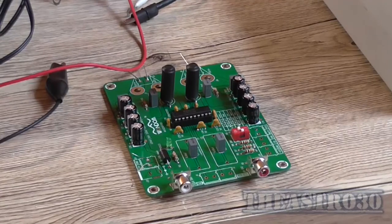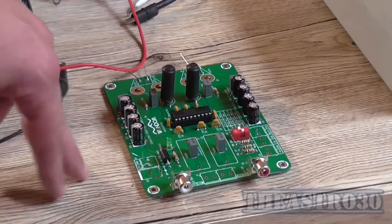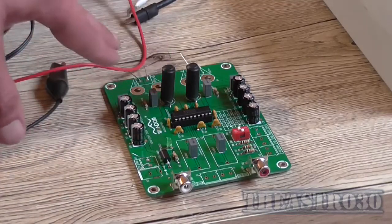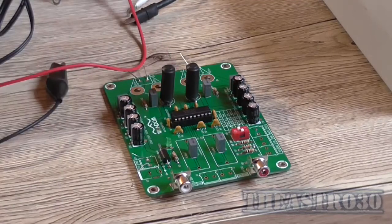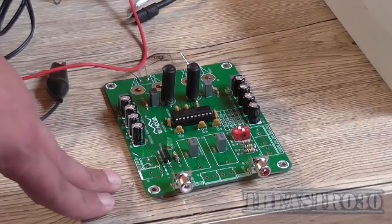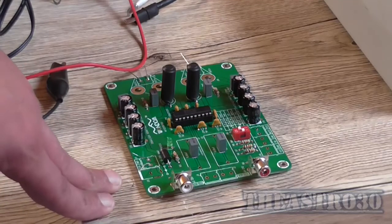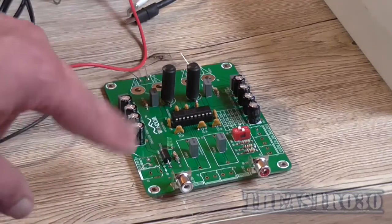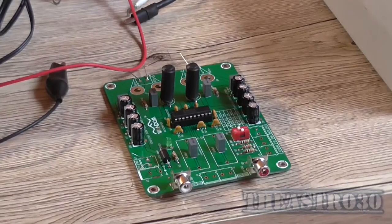Now, I'm revisiting this TPA3122D digital amplifier, which, if you saw in the previous video, well, basically the IC shit itself. That's probably because it was running close to its maximum VCC voltage of 30 volt. It was actually running at around 31.6 and probably eventually killed the chip. So I'm going to retest it again because I've got a new replacement IC.